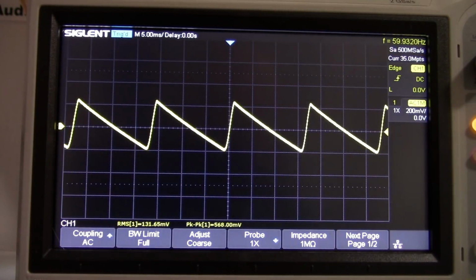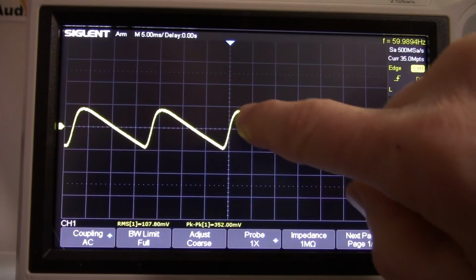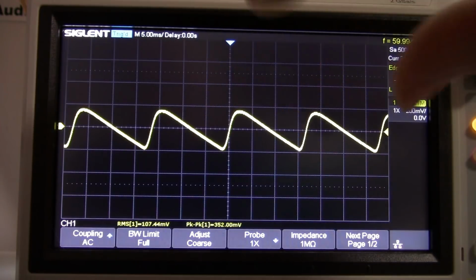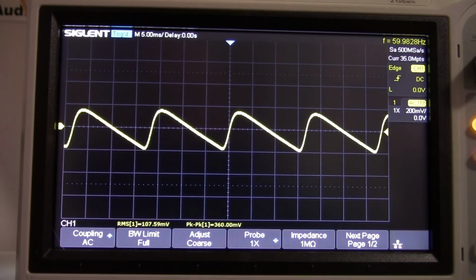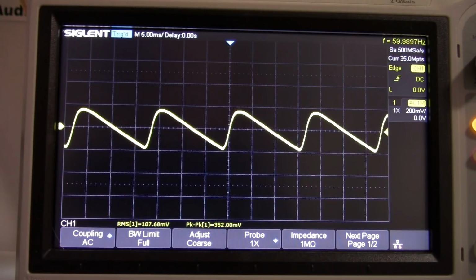I'll pop in the capacitor there. And yeah, it did a little bit. It got rid of that sharp peak. It lowered the voltage a little bit. However, it's really not that good because the resistor I chose is 10 ohms. You want to choose a value that's not going to cause you too much voltage drop. I didn't want to really lose more than about a volt with a 100 milliamp capable supply. So, you know, that's a volt there. So that's why I chose 10 ohms. But 10 ohms with the 220 microfarad capacitor, the pole frequency is above our ripple frequency. And that's not effective enough.